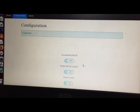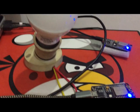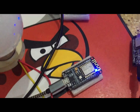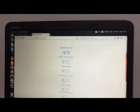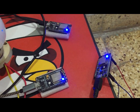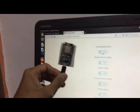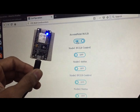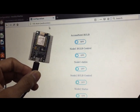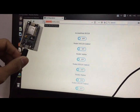Now we are going to turn on or off the onboard LED of the access point — it is already in the on state. Here you can see the state has changed. I am turning off the access point LED to find out which ESP8266 is in access point mode. That one is the access point. Now bringing it closer to the screen — I am turning on the onboard LED. See, this is the access point and I am controlling its LED via the web server. You can simply type this IP address on your cell phone and have the same GUI there to control any home appliances connected to this network.